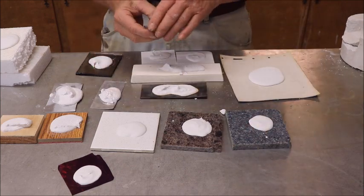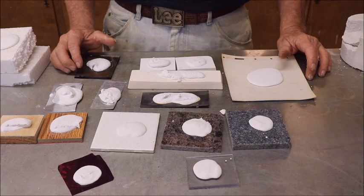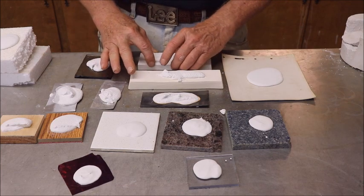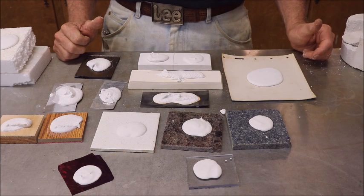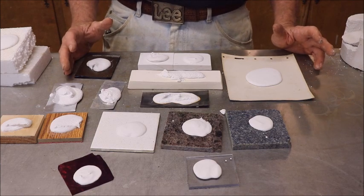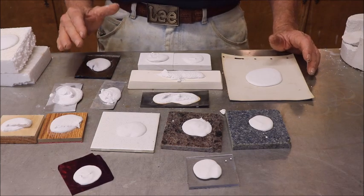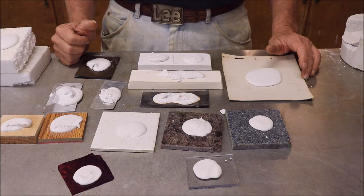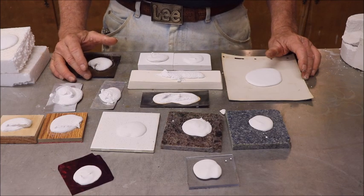It sticks to stainless steel — pretty much everything else comes loose. The slicker the surface, the easier it's going to come loose. So that's just a quick down and dirty on a few things to find out what plaster would stick to. That may be helpful when you start making a mold and you're pouring plaster over a particular object. You can coat your master — regardless of what it is — with Murphy's oil 50-50, you can spray it with vegetable oil, and some people use Vaseline although it's rather messy. Those are some mold release agents you can use. Get on YouTube, check out mold release agents. If you have some great ideas, put them in the comments below and share with me so I can expand my knowledge on using plaster.